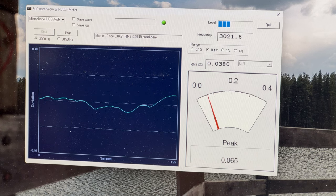This has this little sliding latch plate, or sliding latch thingy, that the 666ES had, so beware of that, but basically the same type of deal here. Just gotta pop this switch apart, and then we can clean it up real good and put her back in. Just releasing the clip and spring first. We'll do the longest one first on camera.